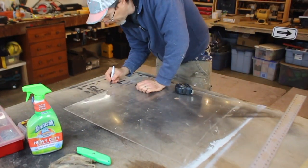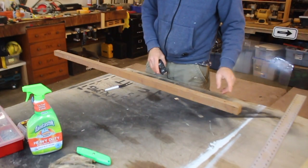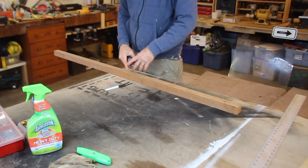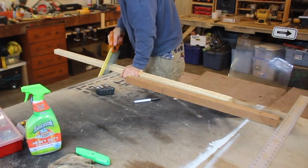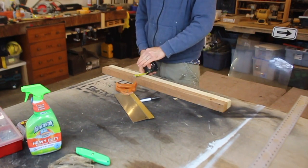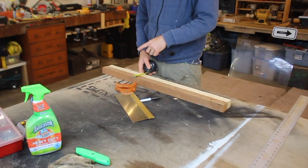Write that measurement down — the size of that rectangle is exactly the external size of the box you're going to make. Cut two of the long pieces exactly to your measurement — mine are 33 inches. The vertical pieces are going to be shorter because you need to account for the width of the top and bottom pieces. Stack the horizontal pieces side by side and measure their combined width — mine come to exactly three and a half inches. Subtract that from the height: mine are supposed to be 24 inches, so I subtract three and a half to get 20 and a half.